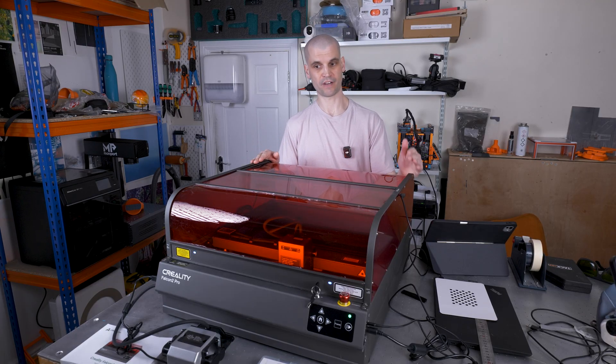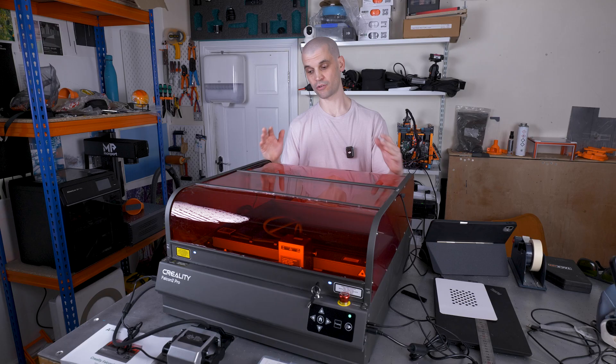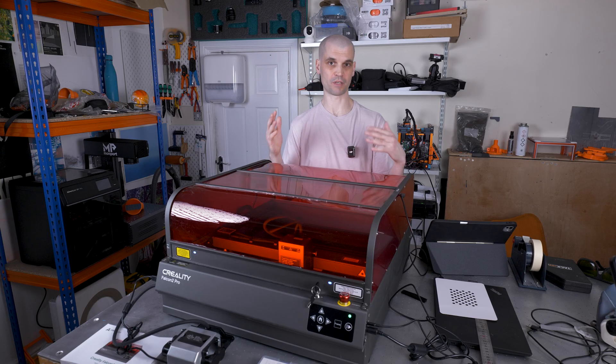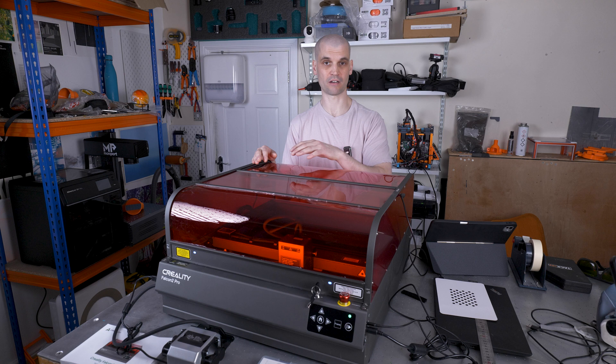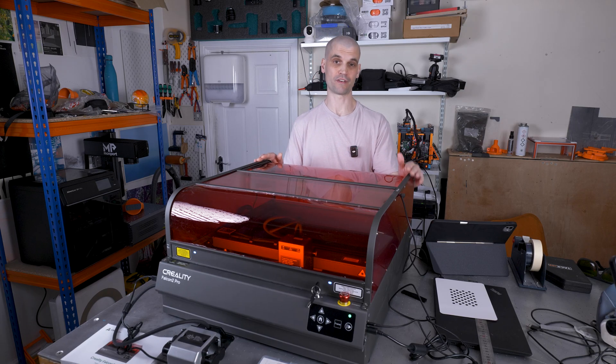So that covers pretty much everything from this review. The safety features, the enclosure, and the integrated camera are definite pros — especially in this price range, not many machines have integrated cameras. Build quality is nice, documentation is good, and Creality is a trusted supplier with years of experience, now moving into laser engravers from 3D printing. There's definitely room for improvement in the next Falcon iteration: a better gantry rail system such as linear rails, slightly better accelerations to help engraving speeds, and a better fine-engraving option. But that's it for today — thank you for watching, and please put any questions in the comments below.